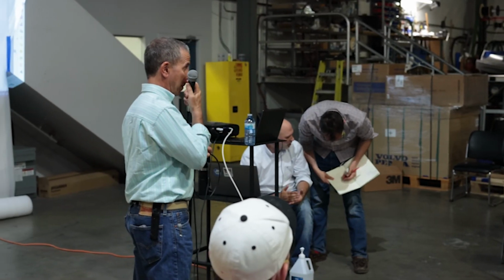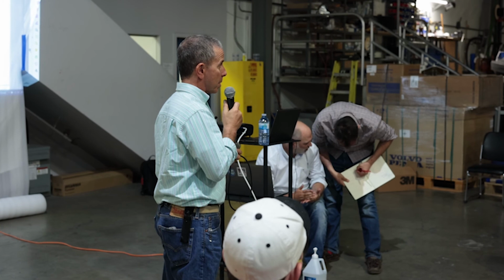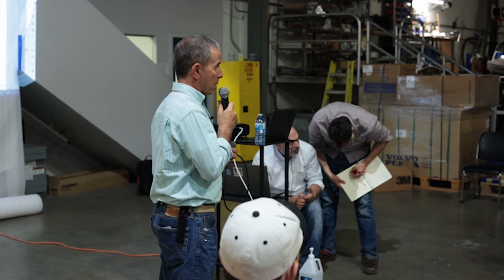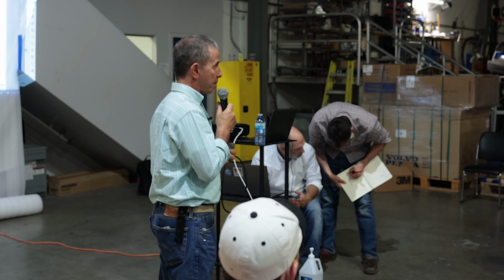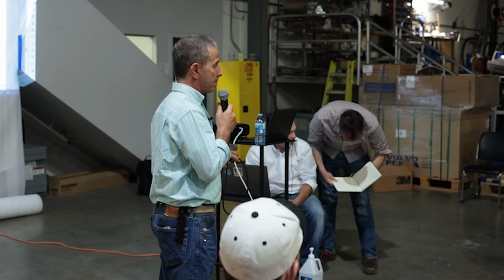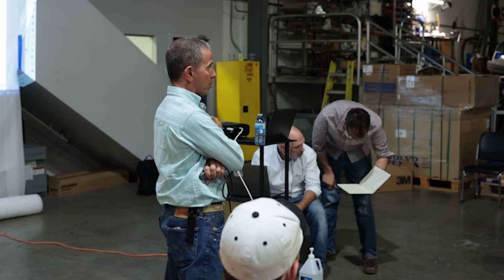I just want to add right now that when we're talking about torquing, we're not as concerned about the paint as we are about damaging the fastener itself, like stretching the fastener, or if it's a composite, crushing the composite. So when we're talking about torques, it's not specific to what he's talking about.